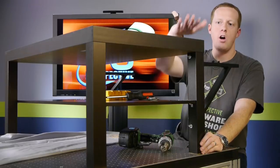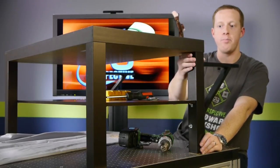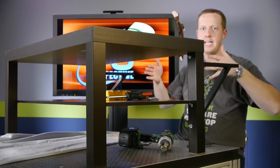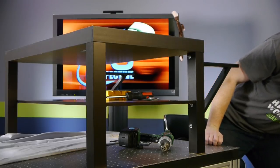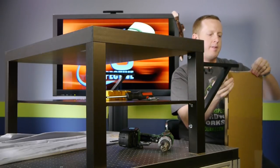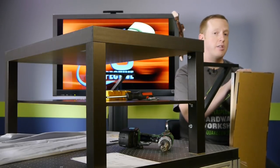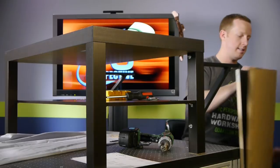We have the brackets on our table now. The first problem we had was that for the top bolt of the bracket you can't really go all the way through because there's a giant thread from where the table leg is attached to the top of the table. So we set it off-center, a little more in on the shelf legs, but I don't think that'll be a problem. The first tutorial we found also recommended not having the shelf screwed onto the arms, because it allows you to move it more easily and it's not really necessary since you're pushing against the legs at that point anyway.